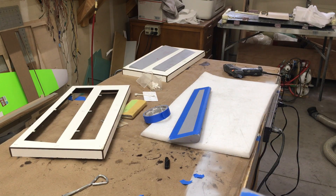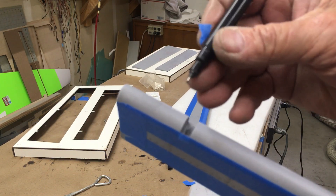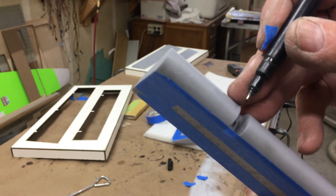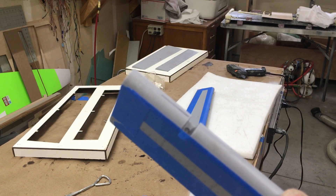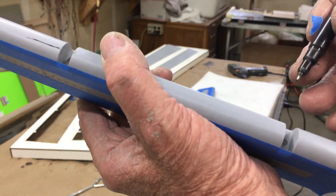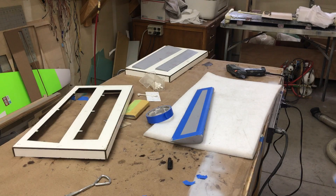Let's figure out the center line so we can put these into the molds. Just find the center — I've got a hinge point there which I designed into it, and you want to just put a mark because this is what we're going to use to align in the top of the mold. So that's what we do — we mark it.